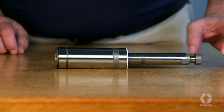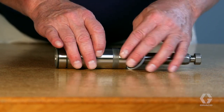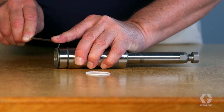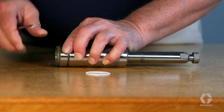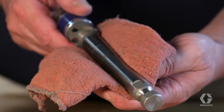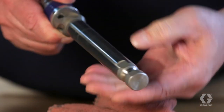The sleeve has two O-rings: a white one at the top and a black one at the bottom. Remove and discard them both. Be sure to remove the white O-ring if it doesn't come out with the sleeve. Remove the piston from the sleeve. Clean and inspect.